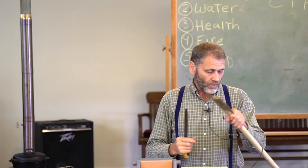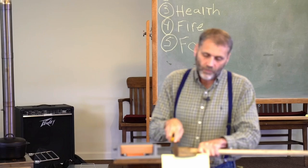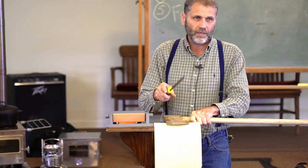You want a secure place to work. If you're holding the knife unsupported it's going to move; I like to put it in a vice so there's no movement. Then just follow along with the file, and I like to keep track of the number of strokes I do to keep it even on both sides.